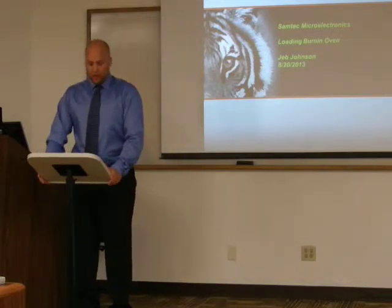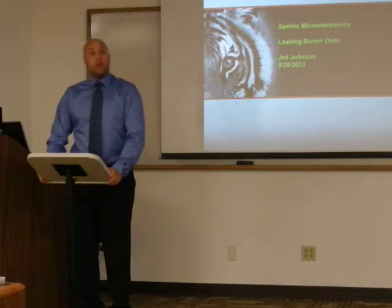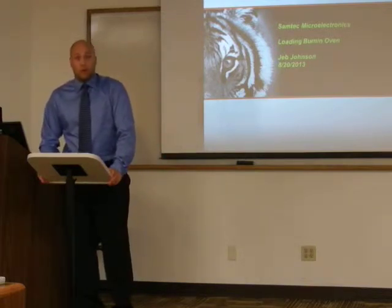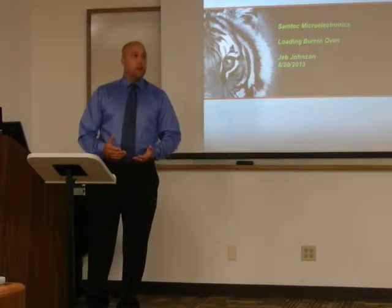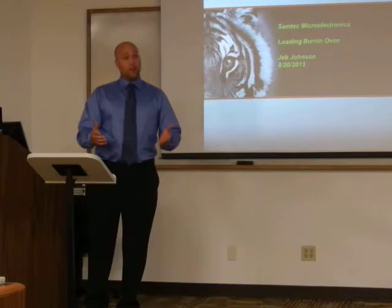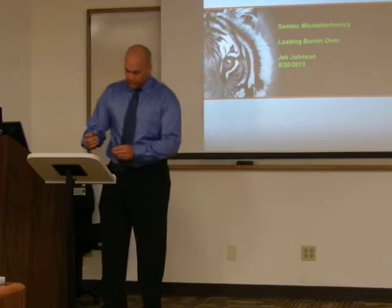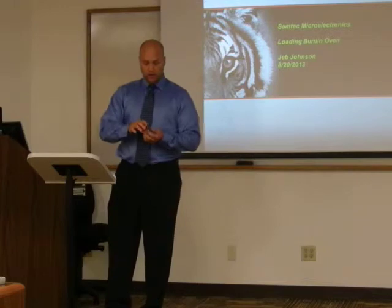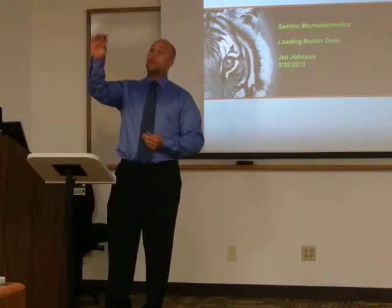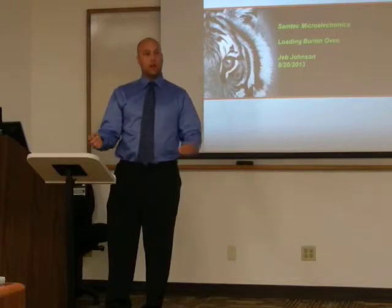All right, everybody, we're going to be going over the burn-in process and how to load a burn-in oven for running the QSFP and PCI product through the burn-in oven for purposes of aging the product. The reason we do this is to get it in a stable state. Over the course of the life of one of these products, I have two examples: the PCIe product as well as the QSFP product. Both are devices used for high-speed communication between servers, communication equipment, etc.